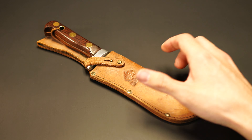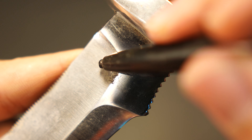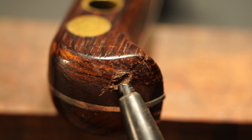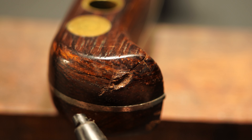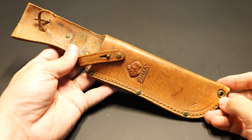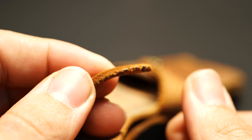Here's the knife we'll be working on, and as with any reworking process, I start by identifying exactly what problems I'm working with. The blade doesn't seem that bad at first glance, but if you look closer you can see there's some corrosion happening, and there are a few deeper scratches that also have some corrosion going on in them. While the edge is actually pretty good for a factory blade, it has a few little nicks and dings that need some work. Moving on to the handle — again it seems fine at first, just a bit dirty — but there's a sizable dent that has led to some cracks forming. The handle is not flush with the spine of the blade, so it's a bit rough on the hands, and the overall shape is a bit hard-edged and not very comfortable to grip. The sheath is also beginning to show its age, getting quite dehydrated, with the little strap on the back having already dry rotted and broken off a few times.